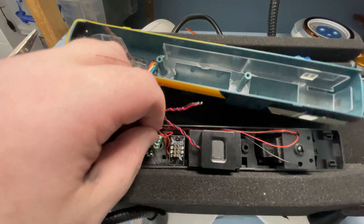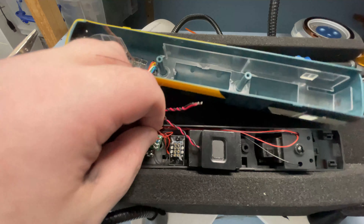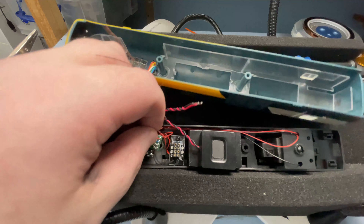With all the speakers from Olden Rails it's pretty nicely soldered and already pre-tinned, which is what you want. I'm going to show you the speaker wire sleeving from Roads and Rails - it's a really good thing. When you're connecting speaker wires you don't want your two wires touching because that'll fuse your engine and you'll end up with a blown chip. I highly recommend going to Roads and Rails and buying this heat shrink wire - it goes onto the wire and stops them from touching.